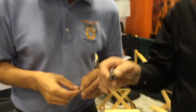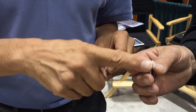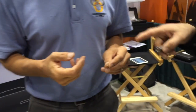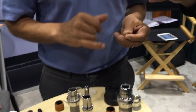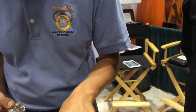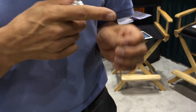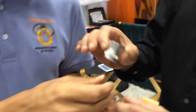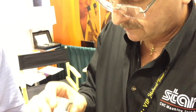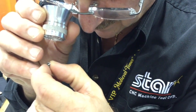There was one modification — because the land is so narrow, we just ground a little off the nose for a nominal charge. The OD is turned on the main spindle; the ID is bored on the sub-spindle. Check out the one-and-a-half thousandths flat around that chamfer on that sharp edge — look how concentric it is. You can't even see a difference. You could never do that with a traditional collet — it would be impossible.